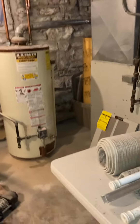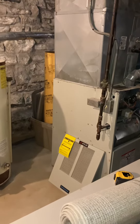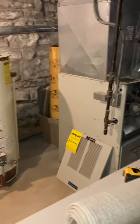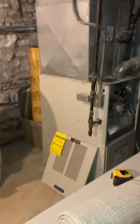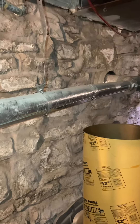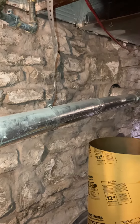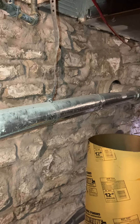We've focused on a furnace replacement and we'll look at an option doing the AC at the same time. We've got reasonable good height and work space around the furnace. Everything's been vented in — I did see evidence of a five inch flue liner that's been dropped down the chimney. So we've got the water heater and the furnace both breathing in there.